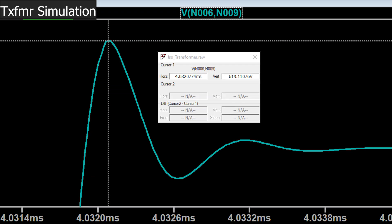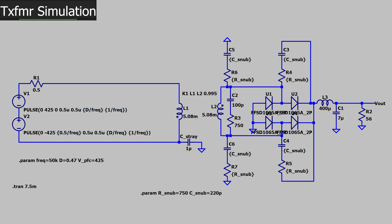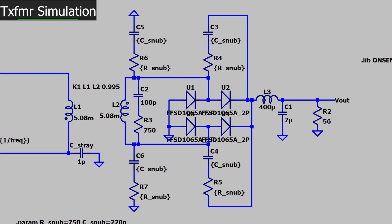If the PFC maintains a maximum output voltage of 425 volts instead of 450, and we keep transformer leakage inductance below 0.5%, I think we've found a solution. I'm planning a snubber across each diode plus a snubber across the transformer itself, placed as close to the windings as possible. These are key points: limit the peak voltage right at the place where it's generated, use the board's trace impedance parasitics to our advantage, and crush transients right at the source.